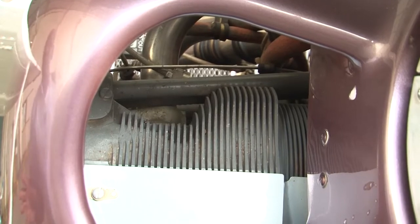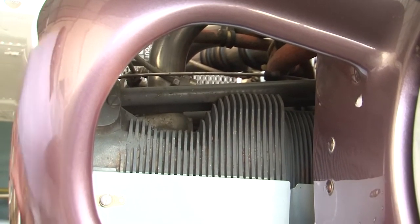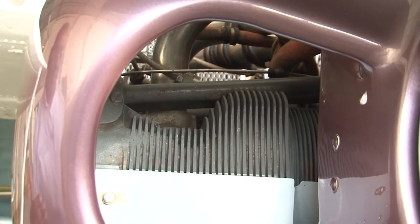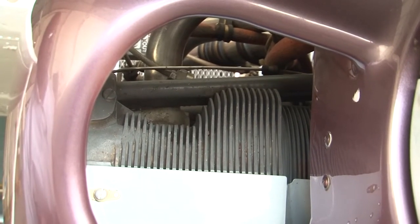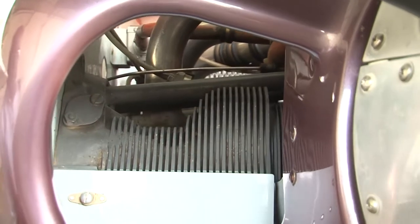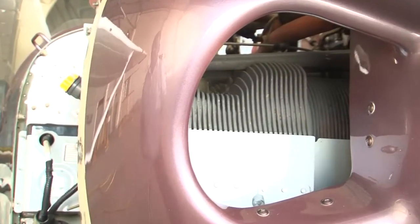So this was the procedure for how we carry out the compression test of all the cylinders. One by one, we have to do the test for all the cylinders. Suppose you have done the compression test and you observe low pressure in a single cylinder, in that case it indicates that air is passing through the piston or by the valve. But if the air is discharging from the breather or the oil filler tube, that indicates that the leakage is in the area of piston and rings.